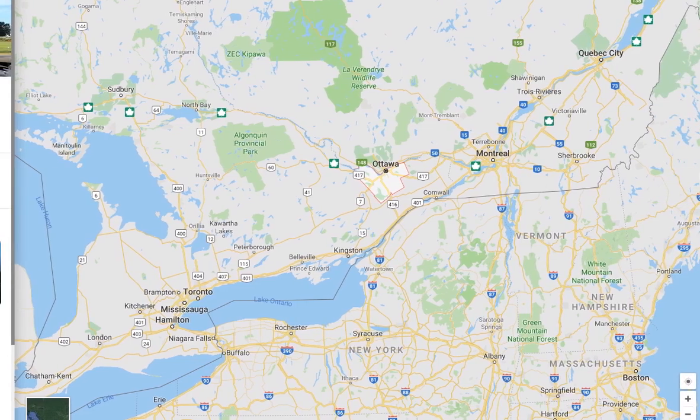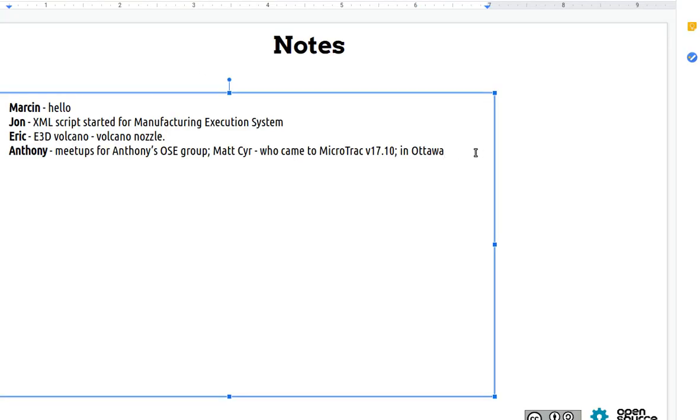Does Menards or any of those stores have any of these refractories that we can just get at a local store? Yeah, they have similar stuff. They usually contain silica, which is a bit of a bummer, but it's probably fine. It might not be a bad idea to just order some stuff off Amazon for $50 or something. They do use calcium aluminate cement, but they also use fillers that are silicate.